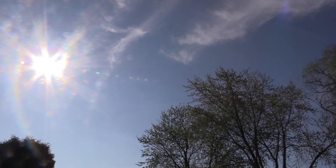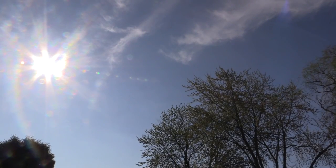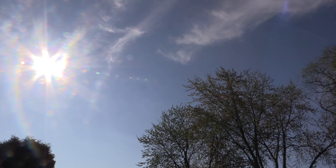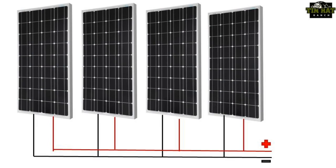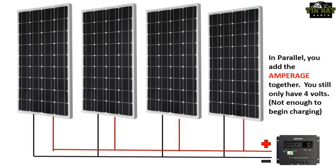As I said, the efficiency that the spec sheets speak of is never adequately explained. Kicking up the voltage saves some in transmission losses, but the rest of the magic, as they say, is in the math. You see, right as the sun peaks over the horizon, your panels start generating voltage. This voltage might be a meager, say 4 or so volts. If you had wired your system in parallel and connected them to a PWM controller, this power wouldn't equal the 13 or 14 volts necessary to charge a battery. In short, the power is wasted.